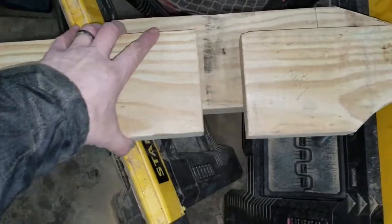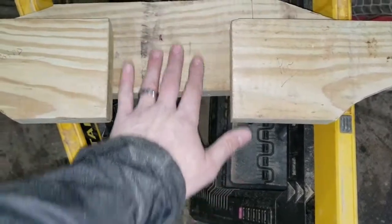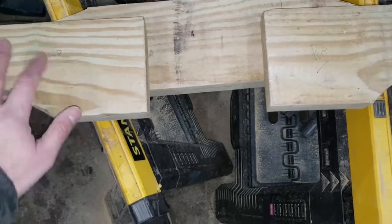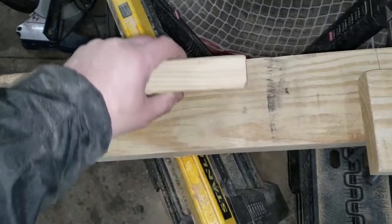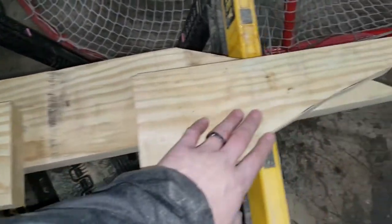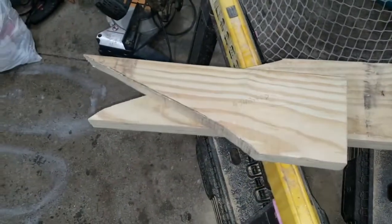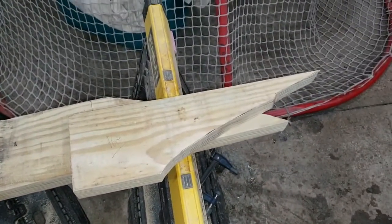I got them cut out — had to use the jigsaw, and the reciprocating saw probably would have been much better but that's down at the boat. This is what we ended up with: starboard and port. The idea is that in here is the centerboard trunk and this is going to get glassed over. They're fairly thick and should make a good bulkhead. Hopefully these things will fit tomorrow — all I've got to do now is wait for the weather to warm up enough to work with epoxy and resin.